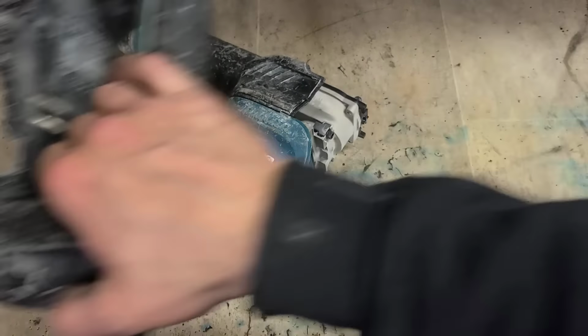Spring missing there too. There's meant to be a spring on top of here holding this stuff down. Get that out of the pit. And there's four ball bearings here. Get them out. Then you can take out this ring. Sleeve off. Then you can take off that cover.